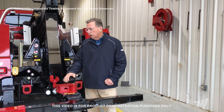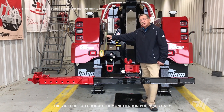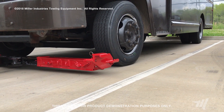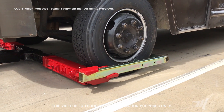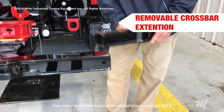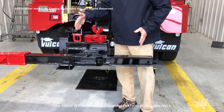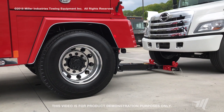With the low profile crossbar you can see the driver's side grid at full extension. This allows you, either using the 4,000 or in this case the 6,000 pound L-arm, to wheel lift that front vehicle of that UPS truck or from the rear axle with that 6,000 pound capacity. That goes out a lot further now than what it did in the earlier versions. To support that when you're using the L-arm, we have this adapter that is attached to the end of the crossbar that simply removes by pressing the plunger pin, and now your crossbar is just like the big boys at 45 inches — meaning you have the ability to get in between the rear tandems or to clear the front axles for whatever is your requirement.